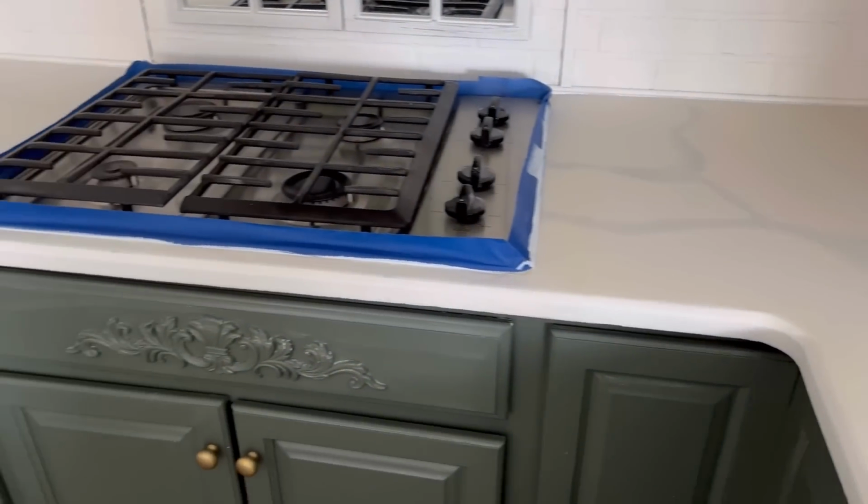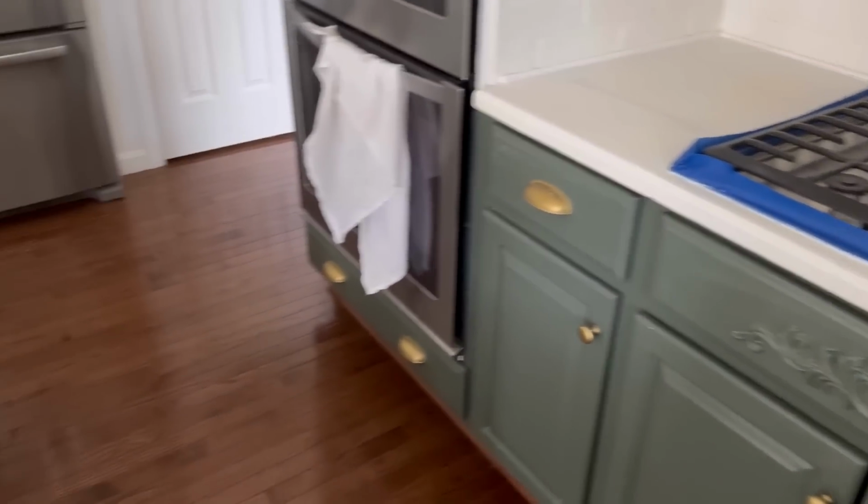Now that the bonding primer has been applied, I just want to show you what it looks like all over again. Just to reiterate, I added a very thin coat of the bonding primer. So thin that you can still see the veining. However, you can't see the yellow epoxy anymore, which makes me very happy. So now that that's been done, it's time to add my first coat of Valspar Bistro White.